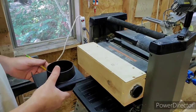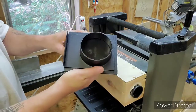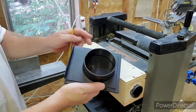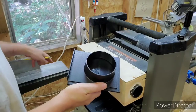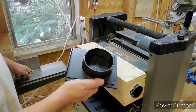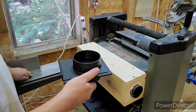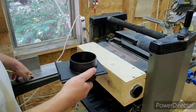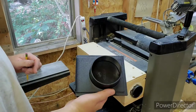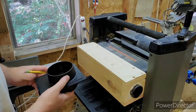After you come out of that Y, what you would do is go through what they call a blast gate. That's so when you're not using a tool, you can shut that off so it doesn't take away from the suction of the other tool you are using. If you're using the jointer and not the planer, then you would have this closed off so you could use the jointer.